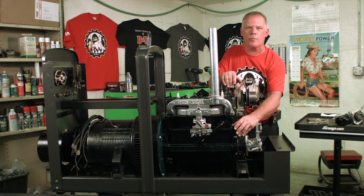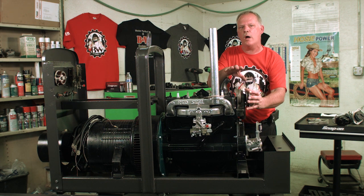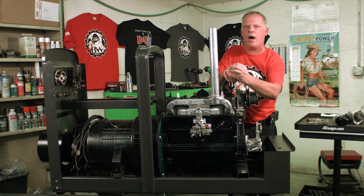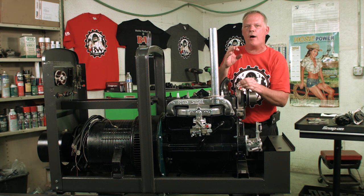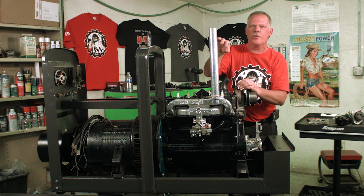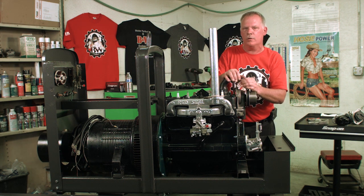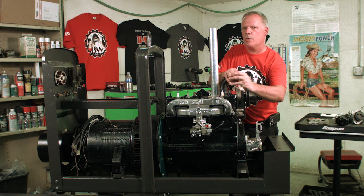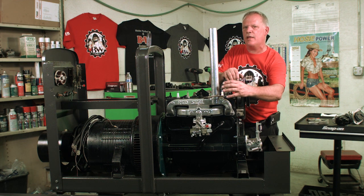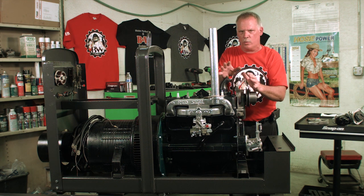You're going to rotate your magneto toward the engine or away from the engine until that DC lines up in the hourglass spot or in the striker of the round cylinder hole that's on the backside of the flywheel. So basically, on the flywheel side, make sure that DC mark is in that window, and that'll get your timing really, really close.